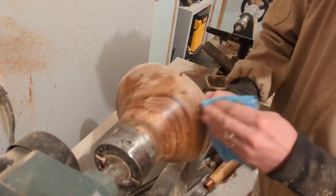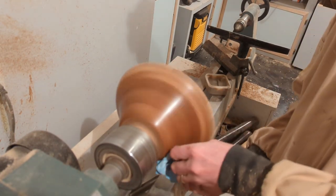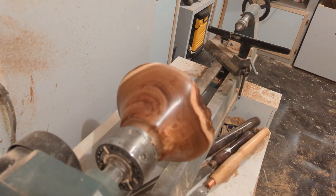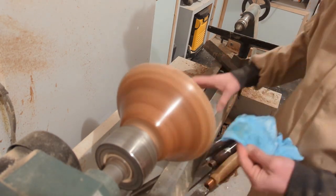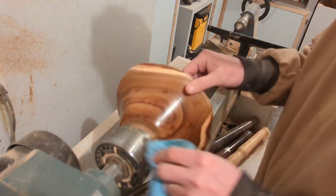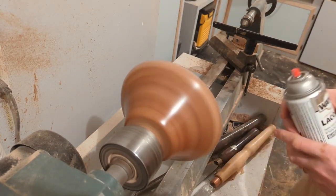Normally I just mention I'm using my abrasive paste and polishing paste and skip over it, but I'll give a bit more detail here. I did make a video on how I made this homemade abrasive paste and polishing paste. I apply the abrasive paste first with the lathe stopped — if you turn it on while applying it tends to throw it across the room — so I rub it in with the lathe stopped, then rub with a paper towel, changing the cloth and keeping going until it's clean before applying the polishing paste. You can see this darkens the wood really well and starts to make it shine.